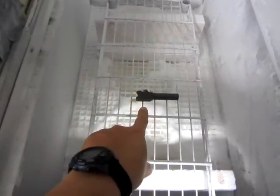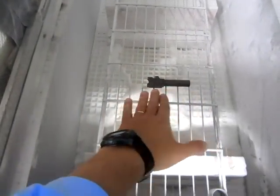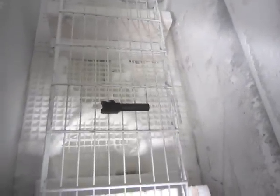Put the part in the dryer, let it dry, probably about 20 minutes. It was bleeding like a stuck pig — you can still see it faintly. Now what we're gonna do is put it in the developer. Developer is basically a talc — you can see it, it's like a chalk. What it's gonna do is attach to the part and draw out all that penetrant, act as a blotter on top of the penetrant, and really make it stand out.